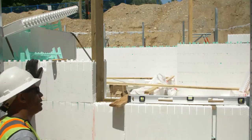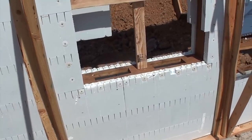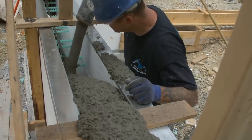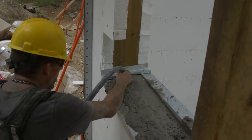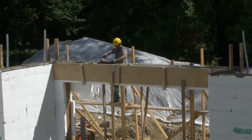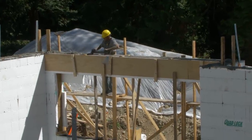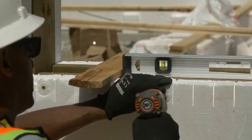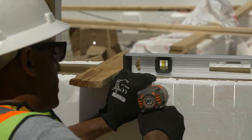Recheck window and door openings for plumb, square, and level. Window sills should be open to receive concrete and consolidation with a vibrator. Sills should be poured first. Confirm window and door lintel dimensions and reinforcement. Ensure that rebar is secured against movement during the pour. Secure panels to internal buckouts that will be left in the wall with screws and windlocks on both sides of the wall.